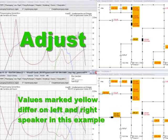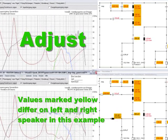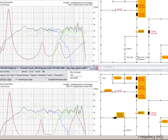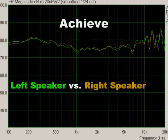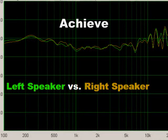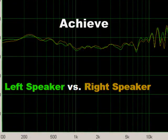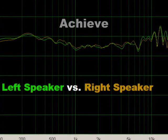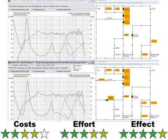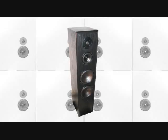If your two stereo speakers have a difference of one decibel or less, the stereo image will be much more stable and clear. To achieve this, you can select drivers and combine pairs with minimal differences, or buy drivers from Scanspeak, Seas, or other high quality brands. But if you want to use drivers you already have, individual crossovers are the best choice. This can still be combined at least with tip number 5 and/or number 1.